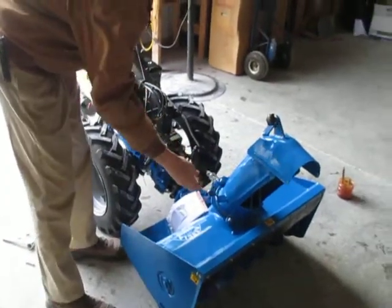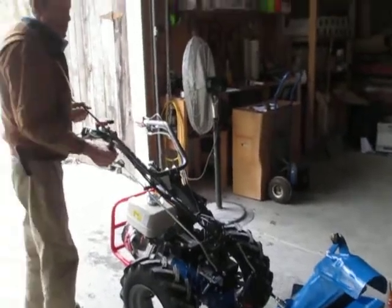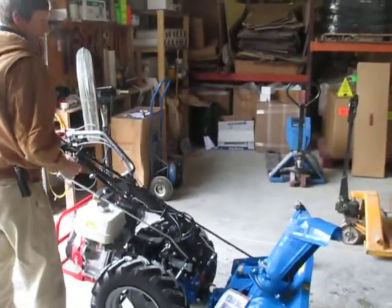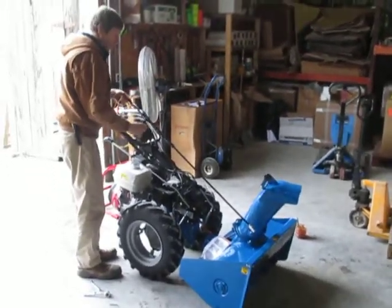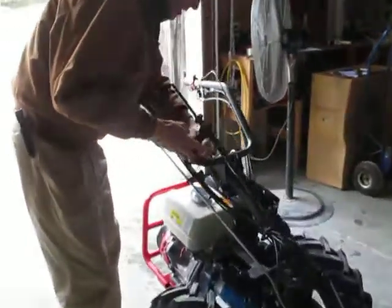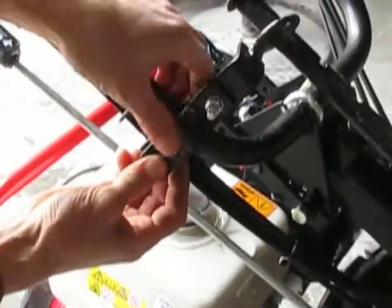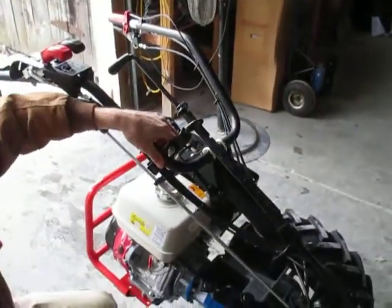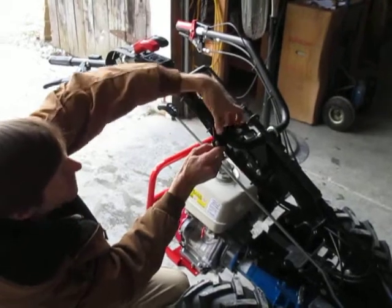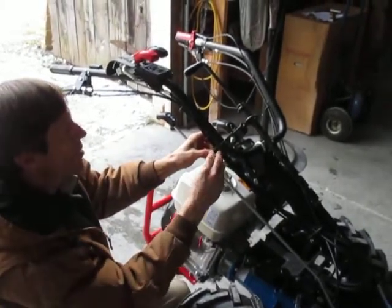Go ahead and put the clevis back on here — this is going to slide through and then push down. The action here is a push and a pull to slide this chute around to the appropriate position, bringing it all the way to that side and all the way back. We want to orient this in some location that's going to work for us in all those positions. If there's a blue plastic shroud that goes over the center portion of the handlebars on both the BCS and Grillo tractors, sometimes with this snowblower chute mounted you just have to leave that thing off because this clamp sort of gets in the way of it. It's not a big deal — that plastic shield is nothing but cosmetic anyway and doesn't help the function of the tractor at all.